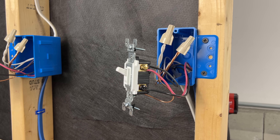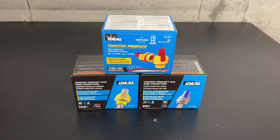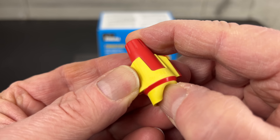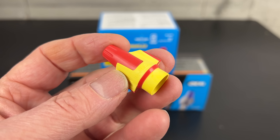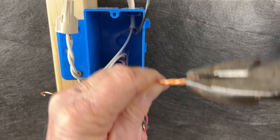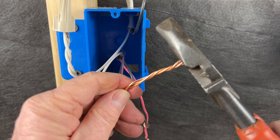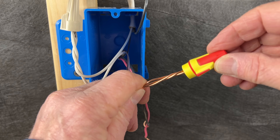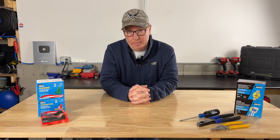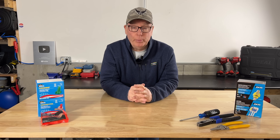I've been a big fan of the tan twister wire nuts for years, but I really love the new Twister Pro Flex wire nuts from Ideal, especially the red and yellow ones. They have a flexible skirt, the widest wire combination range, and they're rated for up to a thousand volts. To use a wire nut on ground wires we'll simply twist the wires together along with a tail to the device, trim the ends of the wires if they're not even, and then twist on the wire nut in a clockwise rotation. Pre-twisting is not required by the manufacturers, but from my experience it's a best practice and it'll provide a more reliable connection.